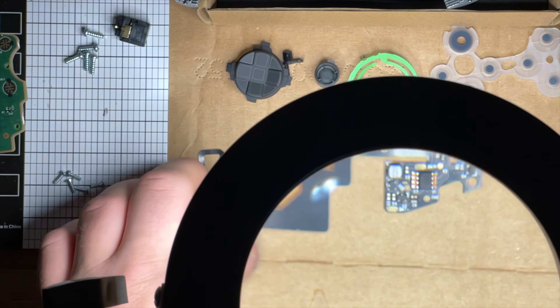There's a connection right there - that little gray connector - and that thing falls out so easily. That little connector goes into this. Basically you're just getting that to line up, making sure nothing's in the way, making sure your board's straight, and then it's just going to kind of push back in with a little bit of resistance but not much. If you're pushing and it's not budging, make sure your wires are out of the way.